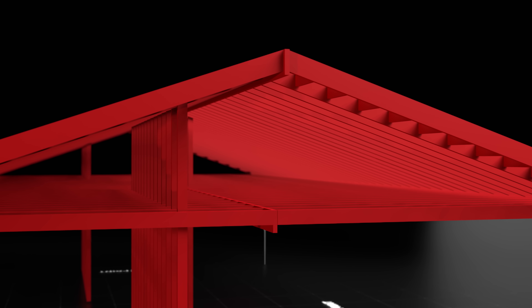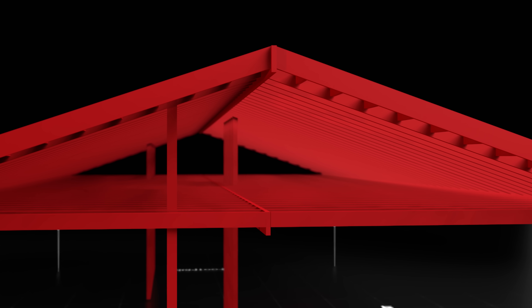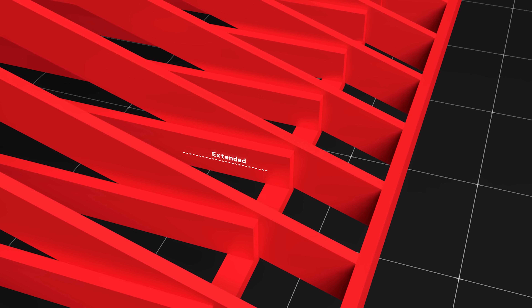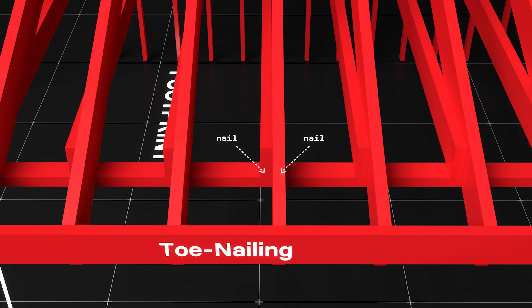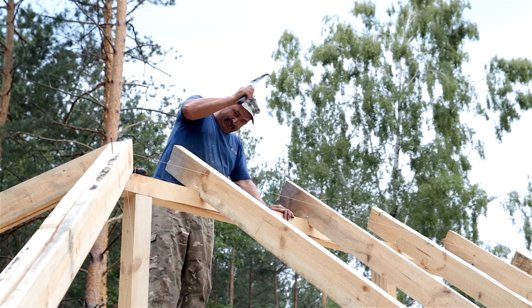If you look closely at the construction, you can see exactly why this is a problem. The roof structure is made from a series of individual sloping rafters. The rafters need to be tied together with collar ties or ceiling joists to prevent them from spreading out and collapsing. But each time sloping pieces connect, one piece is often pushed to one side, extended, and overlapped so that it can be nailed securely to the other members. Where you can't do that, like at the sill plate, the wood is connected with a technique called toe nailing — that's when nails are driven in at a sharp angle through the corners of the wood.